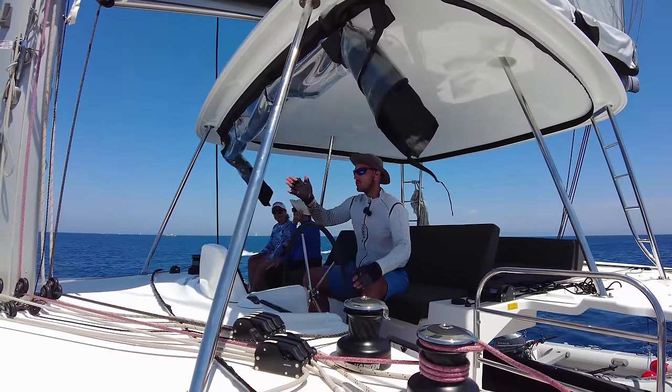Okay, and then here we'll produce the water. So here you can see we're using 1.2 kilowatt, which means that the water maker, that's all it's using, right? And basically in the end, the result is we're just using from the batteries 6 amps. So the engines are producing most of the power and only taking 6 amps from the batteries, which is not much. Now the solar panels are not really working because they're in the shade, but if we had solar panels in the sun, then we would produce positive, would be really great.